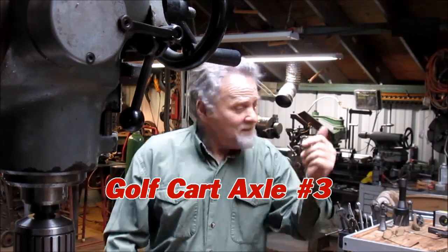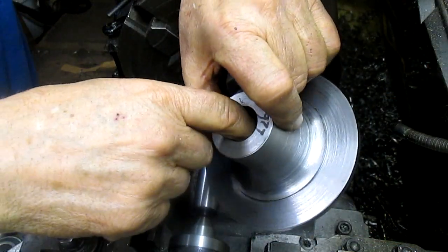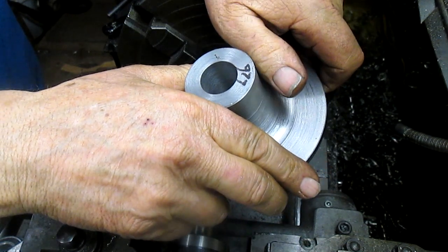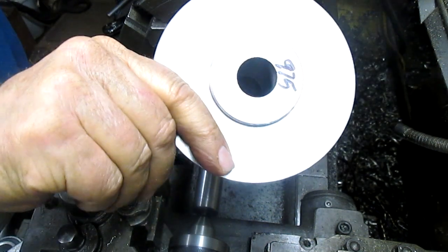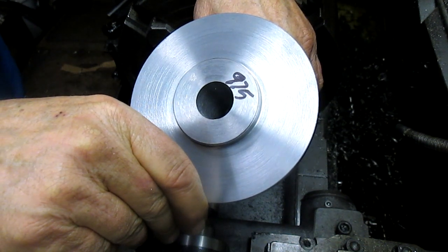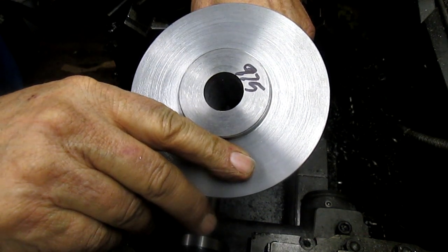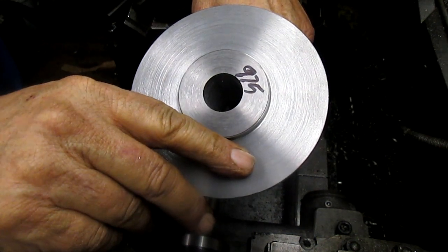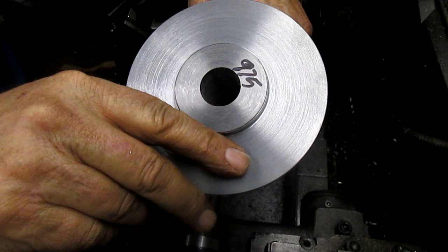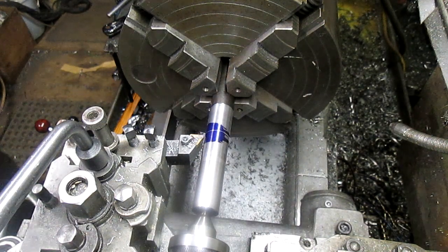Hi, Nick Collier here, and this is my shop — come join me, we'll have some fun. We'll probably come in on the inside of this and trim that out a little bit, maybe a little sandpaper and take a couple of thousandths off. So that would make us — if we wanted a good tight press fit — we're going to have to do 972, and that's a three-thousandths fit. That's a tight fit, but we can heat this up pretty good and get it to slide on. So, 972.